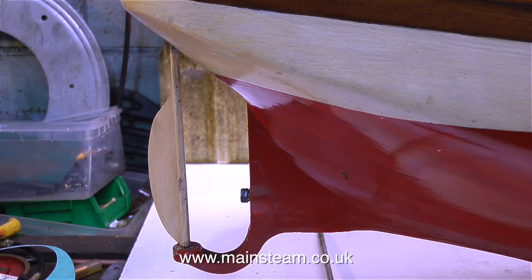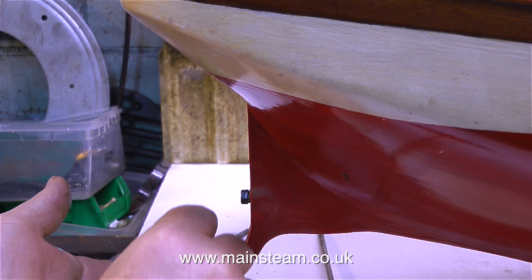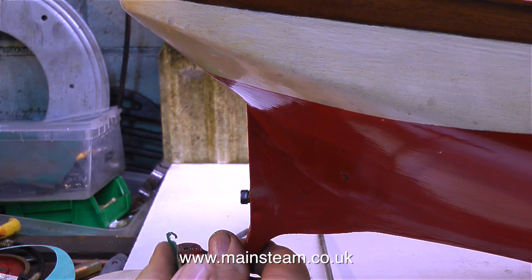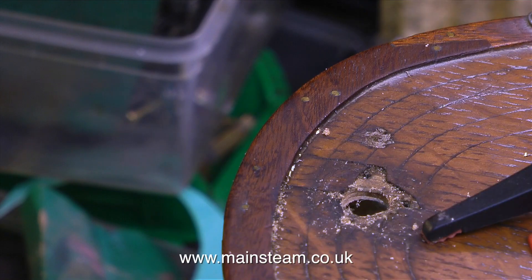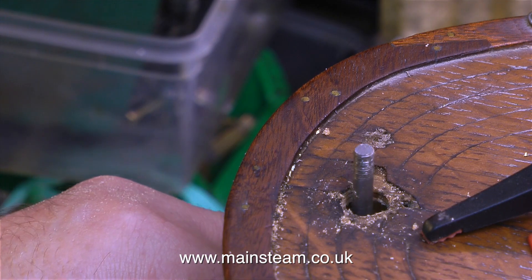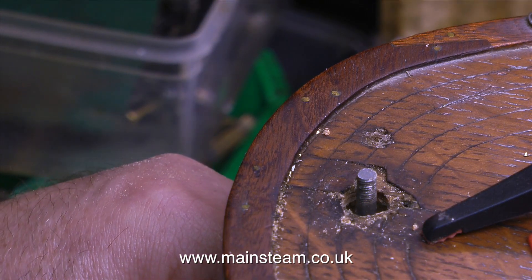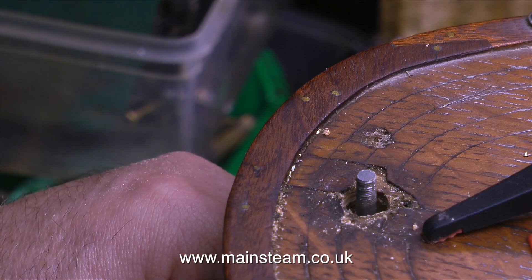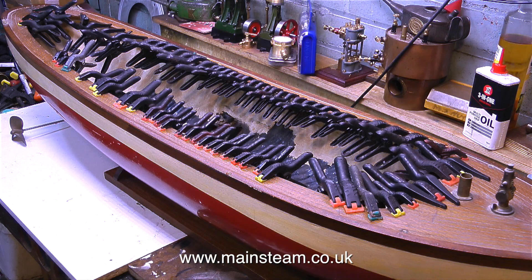If I fit the rudder now it's very free-moving, because the hole in the top is about three times bigger than the rudder shaft. But if I made a close-fitting rudder stern tube now, the rudder would be stiff again. I'm using a bit of sandpaper on the bottom part where the rudder mounts. In this close-up you can see where the original rudder fitting was — and as I said, that's long gone — and you can also see the damage to the decking. Now the rudder fits centrally in the hole in the decking, because I used a rotary file to move it into the correct position. The next job will be making fittings to cover this damage and make the rudder work.